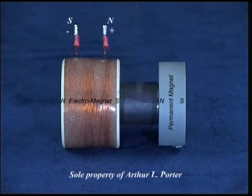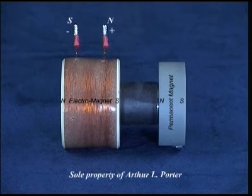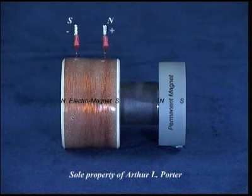Depending on the size of the coil and permanent magnet, the total force produced will be many times greater than that of the electromagnet alone. For example, if the total force, let's say 21 pounds, minus the near to zero number, let's say 1 pound, then the total net force is 20 pounds.